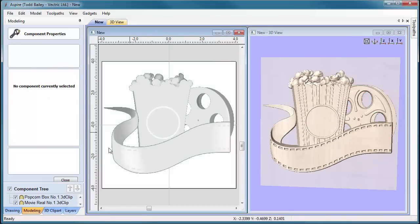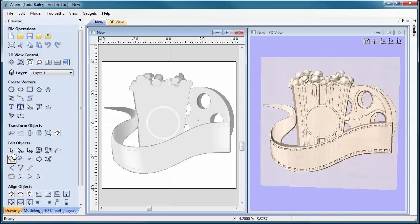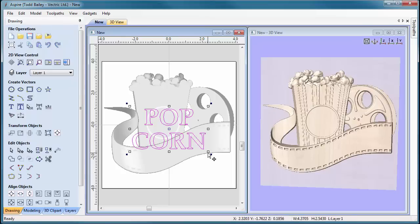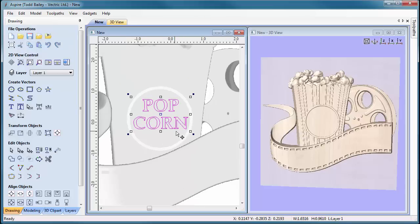For the last part of this layout, we're going to lay in some text on the popcorn box. You could also add family cinema or home movie text and v-carve it right on the film strip, but for now we're just going to simulate some v-carving on the popcorn box. Let's go to the drawing tab, grab the text creator, type in the word 'pop', press enter, and type 'corn'. Make sure it's bold, alignment is center. Click apply and close, then size the text in the 2D view to fit inside the circle on the popcorn box, using cursor keys to nudge it into place and rotating it slightly.